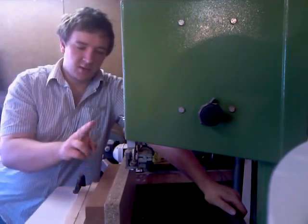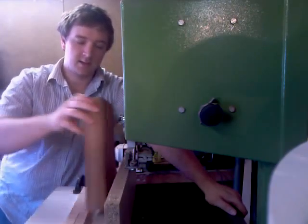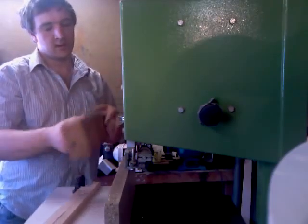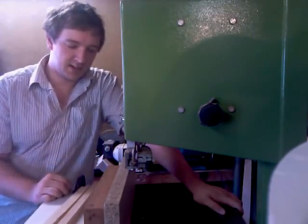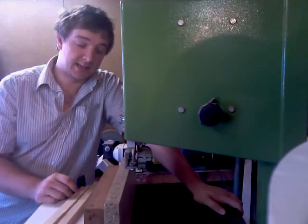The reason is we are going to make two radius sanding blocks. I am going to mount a router on an arc and just let it cut pieces out of this, with the arc going up and moving it slowly down. I am going to make a 14 inch and a 16 inch radius today. If they are successful I will make a 20 inch, a 12 inch and a 10 inch radius.